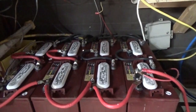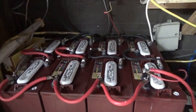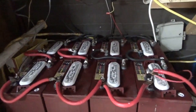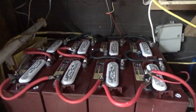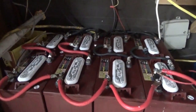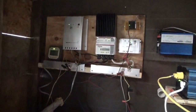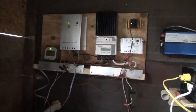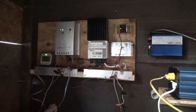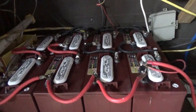To summarize: never add chemicals or acid — distilled water only. Keep your batteries full and charged up, recharge them as fast as you can each day, and you should have healthy batteries for many years. Get a good solar charge controller — cheap, tiny charge controllers will kill your batteries plain and simple. That's battery basics and battery maintenance from Troy at the Do-It-Yourself World and the Off-Grid Project.